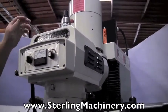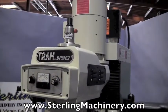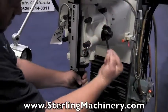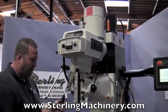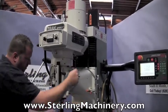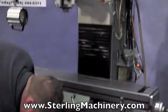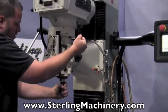Usually what you'd have to do is tighten a wrench up there to get the drawbar out, pull it down, and tighten it back up when you're done. This snap change allows you to go quickly between tool changes. You just raise the Z axis all the way to the top — it pops right back out. Push it back in and now you're in and it's tight. You just push it up to the top and you can easily change out to another tool, just that quickly.